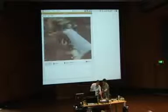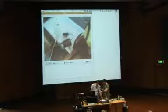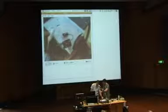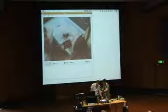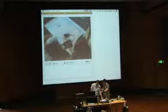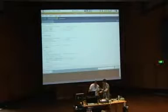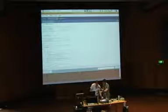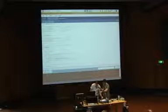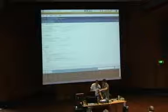Okay, so you can see the little servo motor that's located just there. And then if I pick up this nunchuck and move it around, as I move it, the servo is moving. So it's reading values, and if we were back in the other screen, where it's got values being spat back out at us, you can see that 183, 180, and as I move the controller down, 169, 168, 150, 141, etc., we're getting different values.